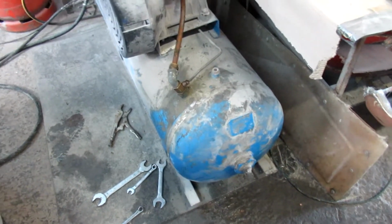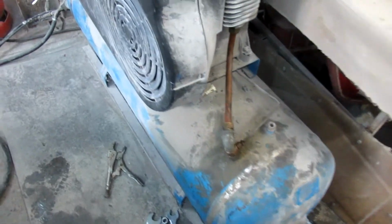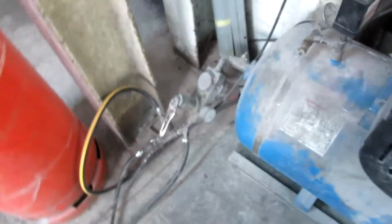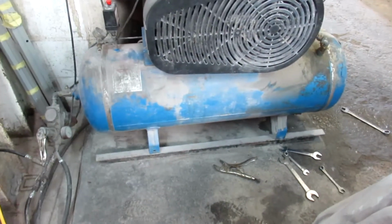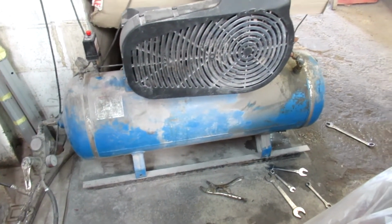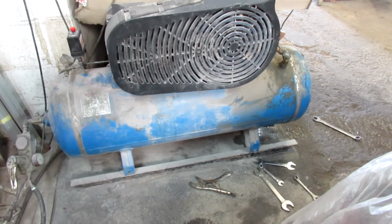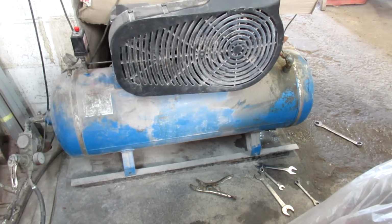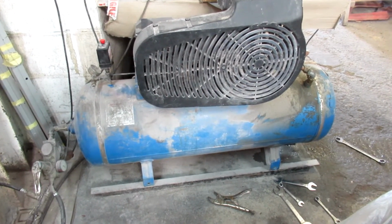So I hope you like the video. As I said, I only put this on because a lot of DIY guys might have a similar problem at some point, in case of an emergency or halfway through a job when they can't get hold of something. All you do is take it out. It's actually called a check valve. Take it out, clean it up. It's only a spring and a couple of caps, and it'll do the job and get you back on track again.